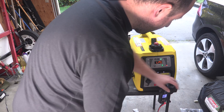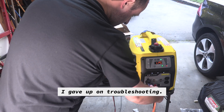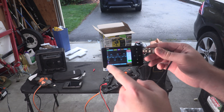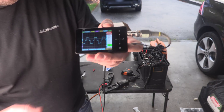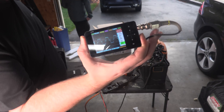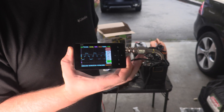Now let's see what a bad sine wave looks like. Just so we can see what a square wave looks like — this is about as bad as you get. It's completely negative, zero, positive, zero, negative, zero, positive. If we hook up an inductive load, which should never be done, you can see that the waves have just gotten wider. Our frequency is 58 hertz, so we're actually holding pretty good. Shutting it off and going back to zero, we can see the pulses get fatter — the dwell time at positive and negative is higher, and that's going to put that much more pressure on an inductive load.